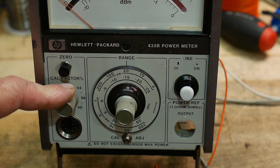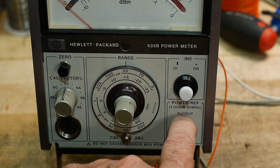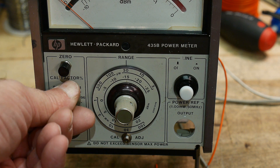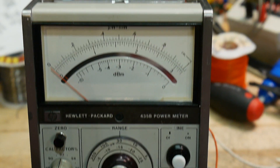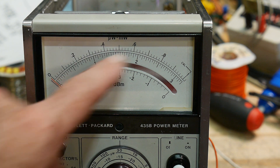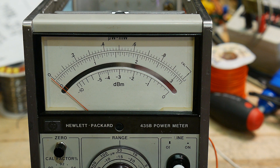I think I want to use this location here to do the collector volts. So this will be that, and the collector volts will go here. This is a funny switch — right now it's hooked up to a bunch of 10k resistors, so you have a whole resistive divider: 10, 20, 30, 40, 50. I thought it might be nice to have the meter read the collector voltage — the max collector voltage. So as you turn the knob, the meter will go up and you'll measure from 0 to maybe 60 or 100 volts and have it come down. That'll be good — make this a voltmeter for the collector voltage.